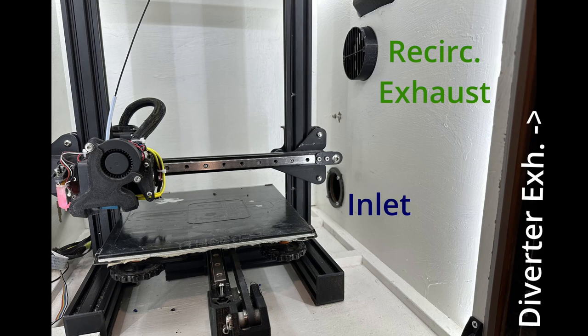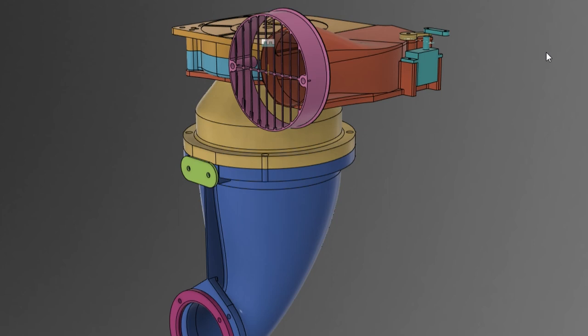The other function of the diverter valve is temperature regulation inside the enclosure. The inlet to the filtration system is at the bottom of the enclosure and the outlet is at the top, which naturally helps mix the air and keep it at a consistent temperature. For plastics like PLA, we don't want the enclosure to be hot at all — room temperature at most is all we want. When I'm printing PLA, I open the diverter valve completely, which keeps the enclosure right around 90 to 95 degrees Fahrenheit. Initially I found that it was fairly easy for the pressure coming off the fan to move the diverter valve and open it. So I actually installed a small micro servo here with the intention of using an Arduino or the Octoprint I have hooked up on the 3D printer in the future to control the temperature within the enclosure automatically. But for now, the servo just keeps the diverter valve in place and I manually adjust it.